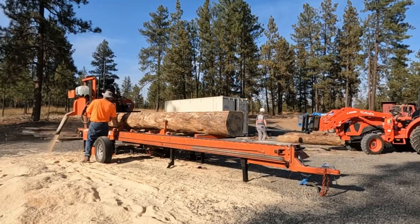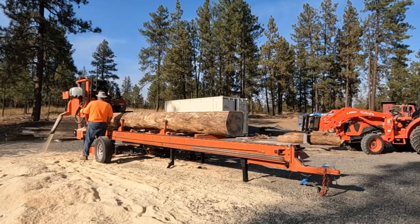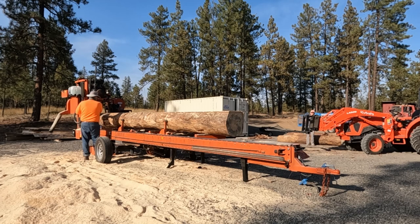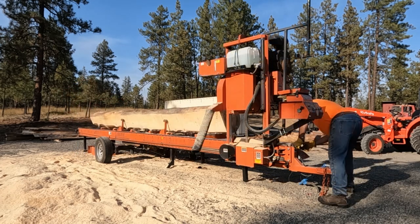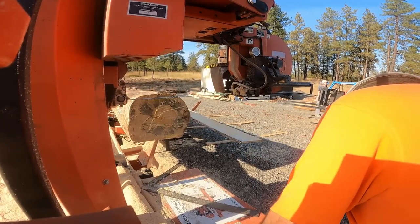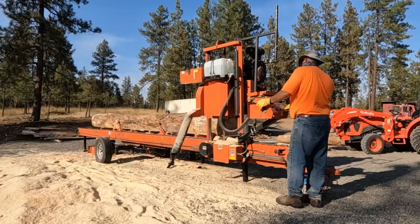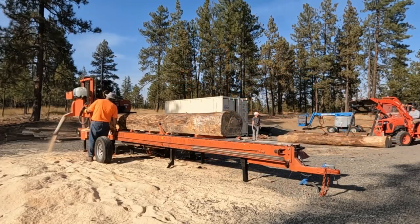This is one side of the width of the cant. So I went ahead, I took the cap cut, looked at where I was at and said, okay, I'm going to dive a little bit deeper and then take a flitch cut out, make sure I got enough face to make my 2x, and notice what I did right there. I flipped it 180 degrees.